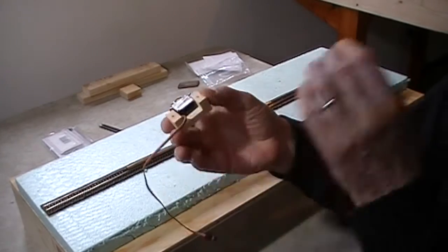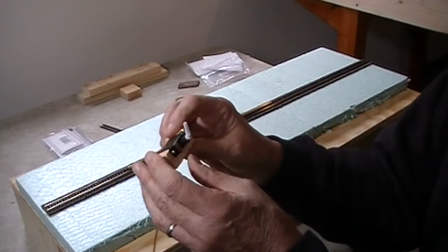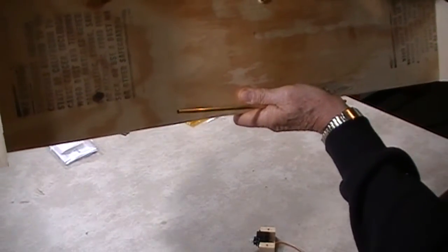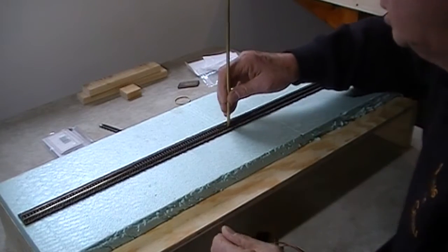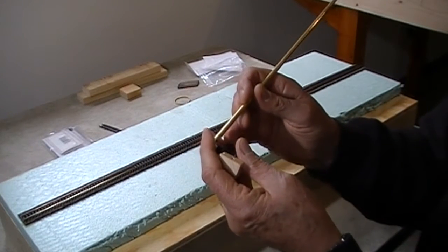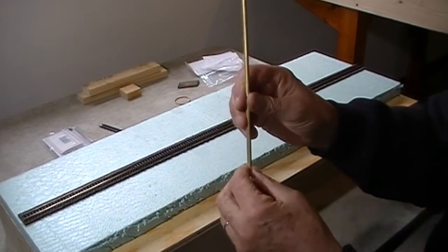For the next part, I took a spare piece of wood and notched it out. I have my little servo and we're going to use that to raise and lower my quarter-inch rod. I've installed the other piece of tubing in the hole using a little bit of Gorilla Glue. To keep this aligned, my plan is to cut a slot in here so the rod will ride in the slot, unable to turn, but will move up and down in the arm and keep it from rotating clockwise or counterclockwise.